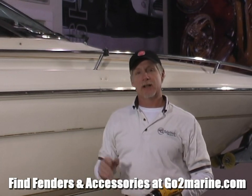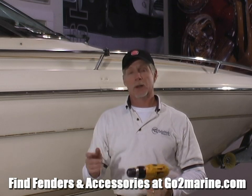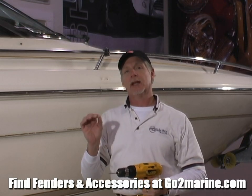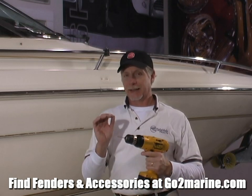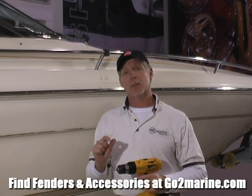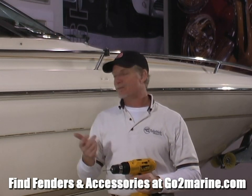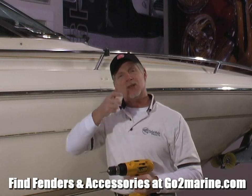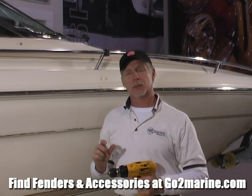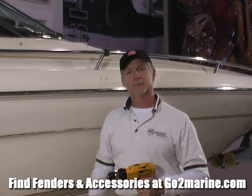A couple words of advice on drilling through fiberglass. Drill straight and drill slow with a nice sharp drill bit. As you go through, as it starts to break into the gel coat, just let the drill do the work. Don't push a lot because you don't want to get those little spiderweb cracks from the hole. Once your holes are drilled, it doesn't hurt to take a Phillips head screwdriver or something like that and just go and radius that edge of the fiberglass just a little bit. In the long run, it'll help maintain the nice look of your gel coat.